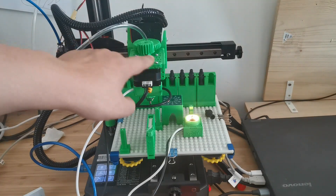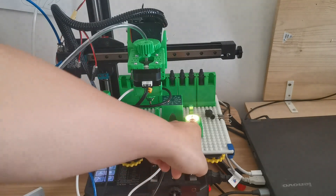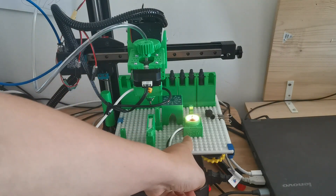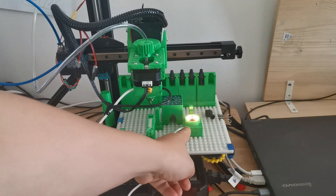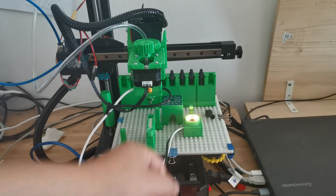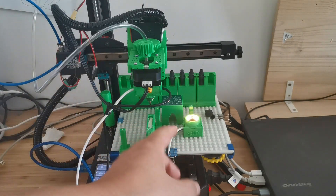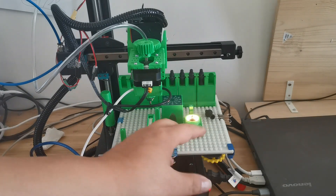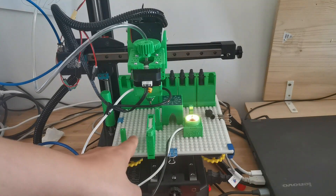The other thing I have improved is the lighting. The bottom camera lighting has been changed — I basically improved the lighting of the system. I now use circle lighting, which gives more even light distribution, making it much more stable when calibrating the nozzle tip or identifying components.